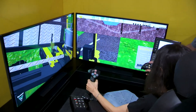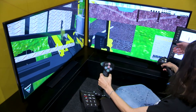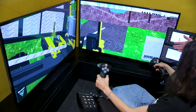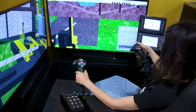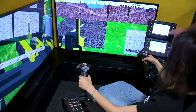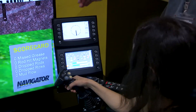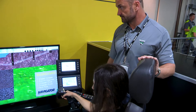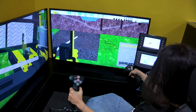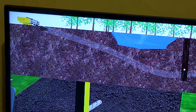Let's ease into it just a little bit — you'll see the rod jump. Keep rotating; it'll start making itself up when it seizes. Now you're ready to go, so let's stop that and open up your vice. As you can see, you're at 26 degrees pitch, six o'clock, so you're still going to keep going down. Rotate and push in. Now you can see on the screen where your drill head's going — the optimal line is dotted on there so you can see where you're at with everything.